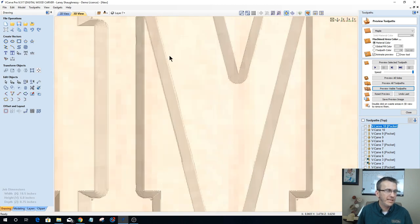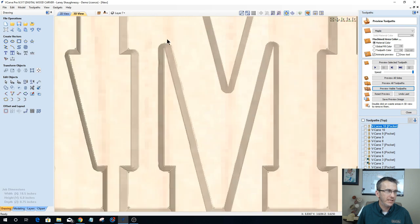Okay, can you guys and girls see this outline right here? This tool mark going here. This is the tool mark left by the ball nose bit because the radius cannot quite get into that corner up against that chamfer, because of the radius of the ball. We don't have a flat edge to get up against that chamfer. So we have this tool mark right around the edge here that is created by that ball nose bit.